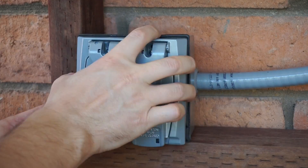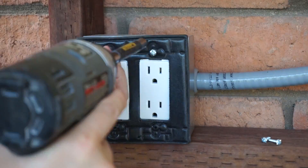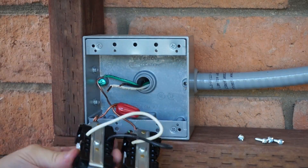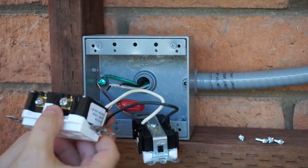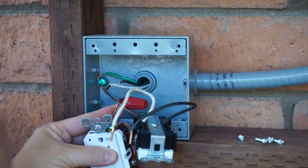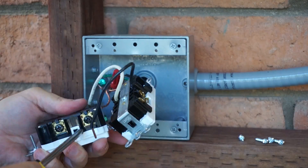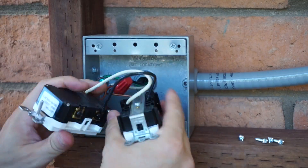I verified that the circuit is up to code, but I probably should have a proper GFCI outlet right there anyway. There are two reasons for that. First, I don't want to have to walk inside and go all the way across the house just to reset the circuit for a problem I actually encountered outside — it would be a lot more handy to reset it while still outside. The second reason is the perception of safety: if you look at it and see a GFCI outlet, you know it's protected without me needing to make another video showing myself testing it.